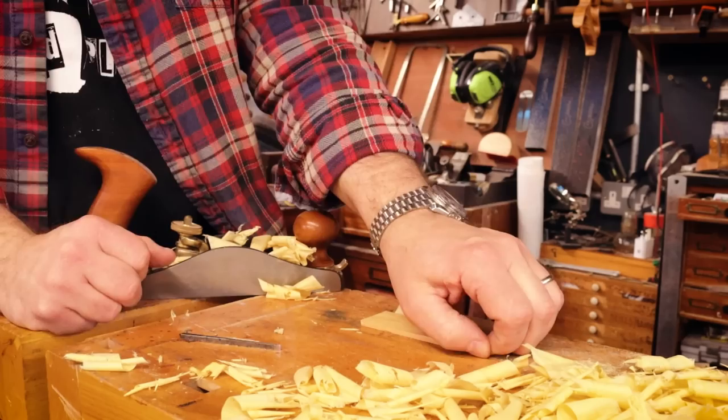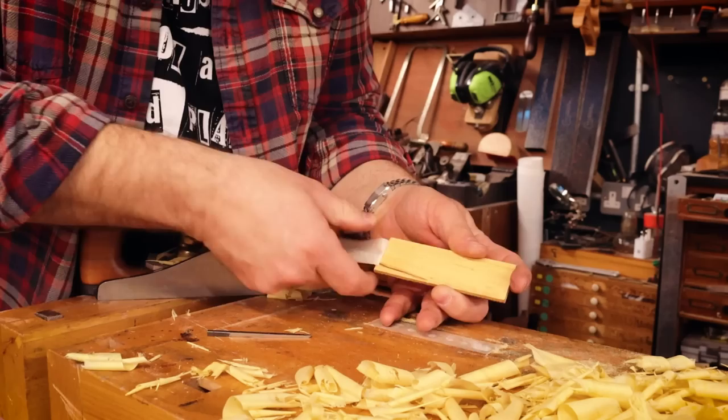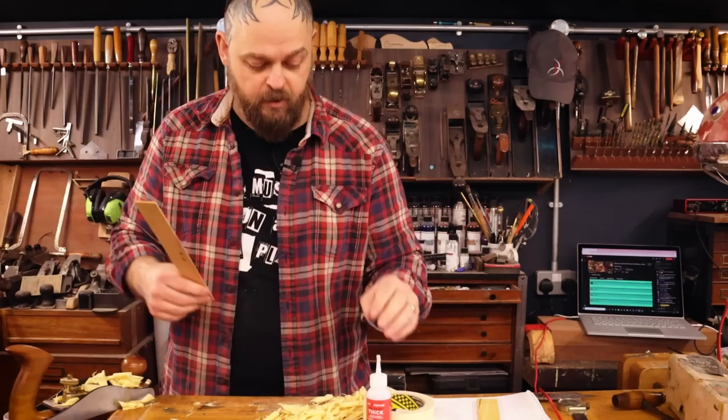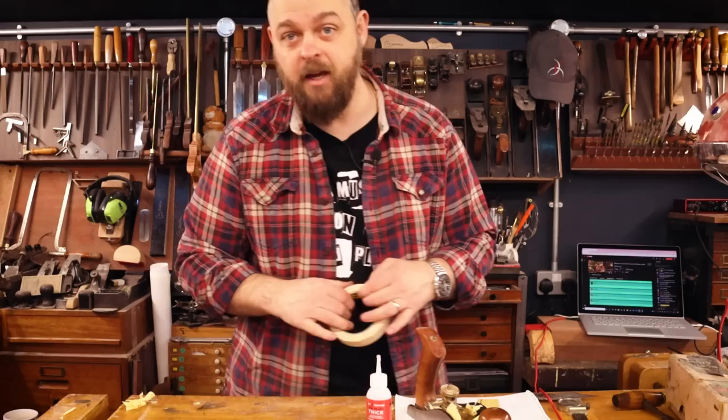There's no movement as long as you burnish the tape down. It's very easy to rip up that way but strong laterally — it's a very cool trick. Now planing down something that is essentially a veneer is always problematic, but the masking tape and superglue trick just makes the whole thing easy, or at least much less likely to have catastrophic results.